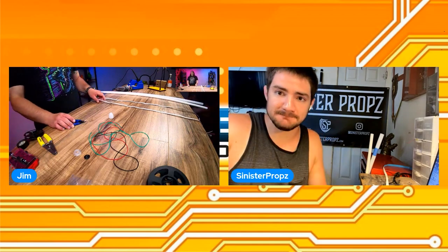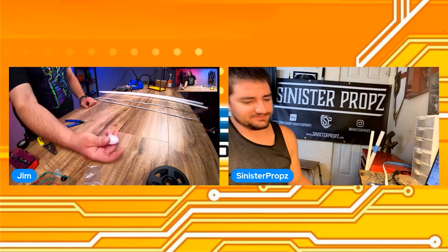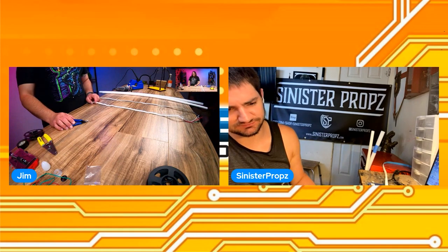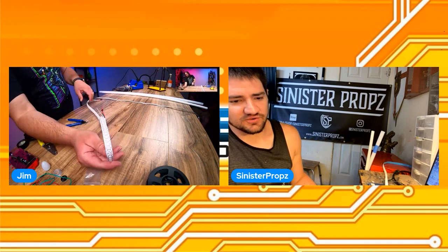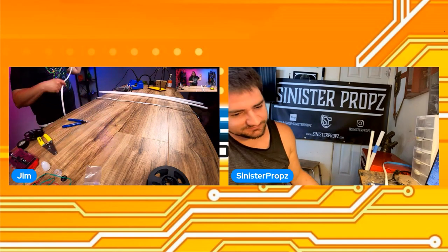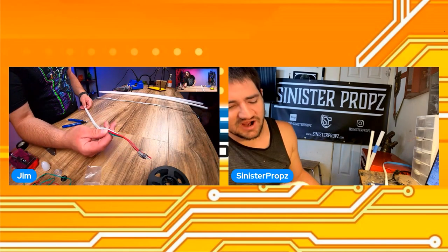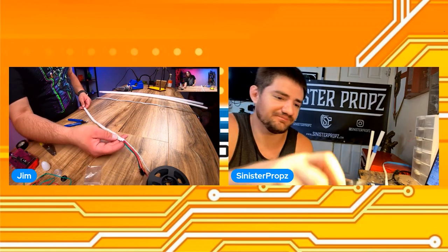All right, so I got my snips. What are we doing? Look at your NeoPixel strip, the one that we just pulled the stuff off of. Do you see arrows? Do you see how they're all going in one direction? Follow them to the top. Follow the yellow brick road. Follow the arrows to the top. If you do not cut the bottom of the arrows, you're going to cut the top of the arrows.